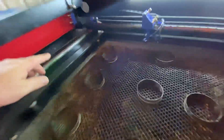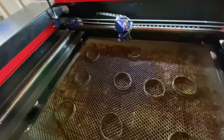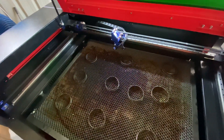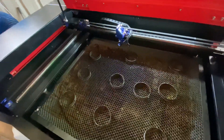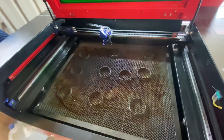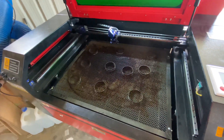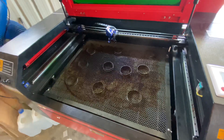Basically, putting the masking tape onto the mirror and firing that pulse to centre the beam into the centre of the mirrors. So after doing that test, it came out that mine was actually out of line. All the beams — all the pulses — were hitting inside the mirrors, but they definitely weren't hitting right on top of each other.